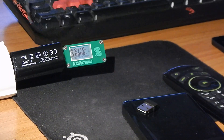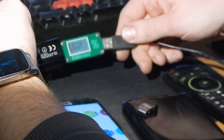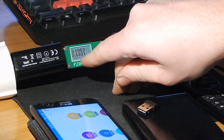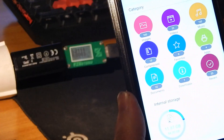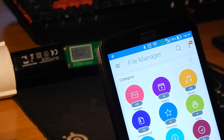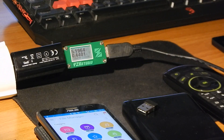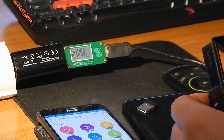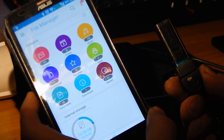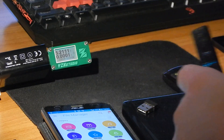Now when I use my custom creation, I stick it in and connect it to the power meter. It's showing 400mA — it's charging my phone and displaying that it's charged. You can see it charging, though periodically it stops due to a poor connection. When I try to connect an external device, it will not recognize it. So the 100K resistor method is not working for OTG device recognition on the Android phone.